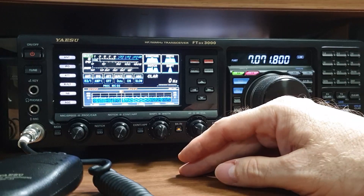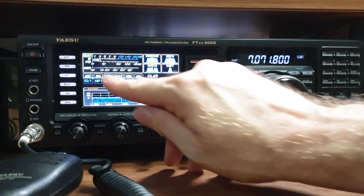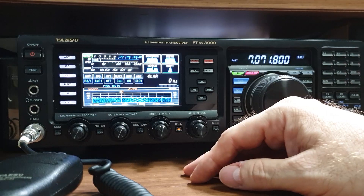You can use other antennas, but I found that the 20-meter antenna works well. It's a Yagi, but it doesn't matter — at 40 meters on receive it's really just a dipole, so if you had a 20-meter dipole that would work well too. What I actually have is a 20-meter two-element Yagi on port 3, receiving on 40 meters, so the signal is way down low, and I'm transmitting on port 1, which is basically a vertical semi-vertical dipole.